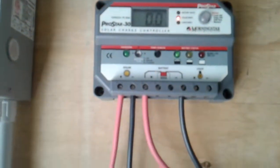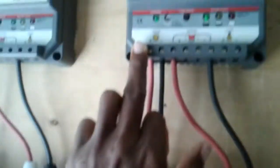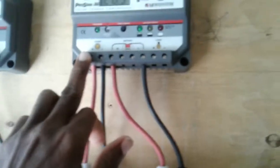It's not complete at all — I have more work to do. I want to add another PWM; I have a space set up here for it. I'm going to put in some additional evening panels because I find that I miss a lot of the evening sun. With another PWM and evening panels, it will work the same way — come into a 30-amp breaker, into the solar connection, and then to the bus bar. Positive to the bus bar, negative to the bus bar — easy setup.